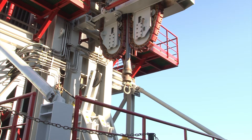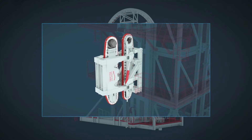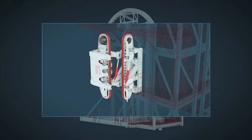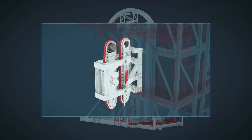The 26-tonne tensioner is mounted on the front of the IDP. Its main function is to support the pipe string and lower or raise it from the seabed. This tensioner has features that allow it to open, giving access to crane in items directly over the centre line of the pipe. It can also be moved back away from the centre line of the pipe to allow clearance for any end fittings to be winched past the tensioner without contact.